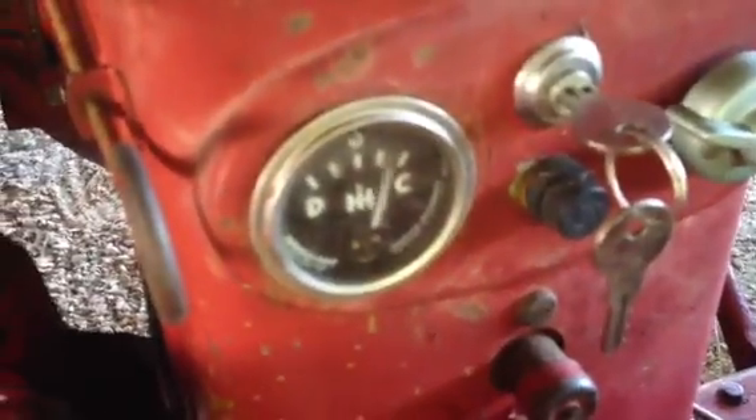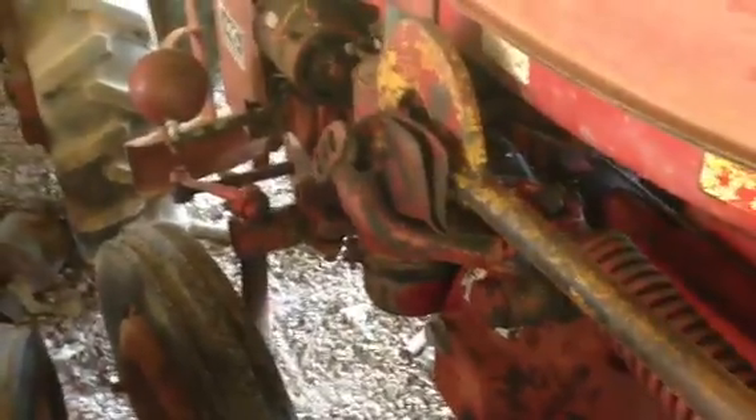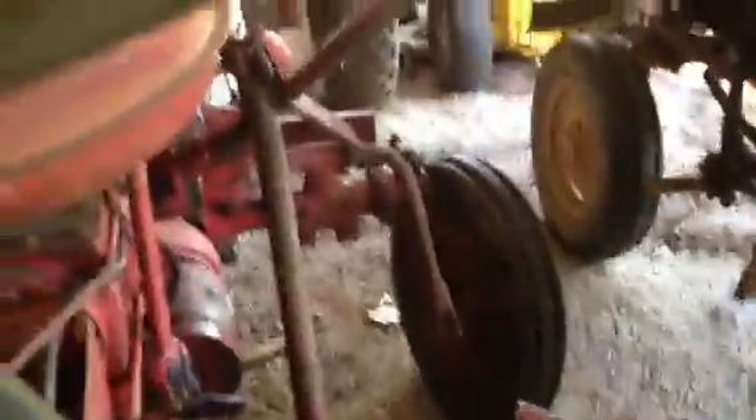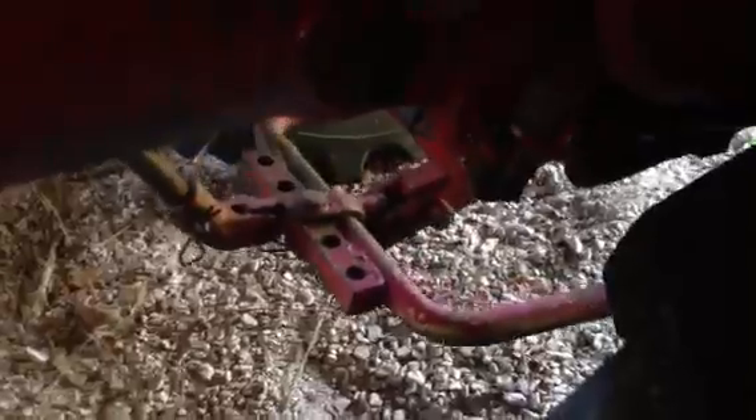It's charging well. You can see the hydraulics here — that's working the back. This lever right here will be your front hydraulics. When you use the front hydraulics with the fast hitch, that controls the depth adjustment. Watch that rod — see? It adjusts the belt for the depth.